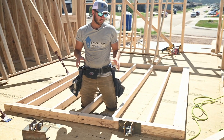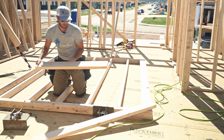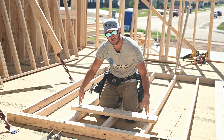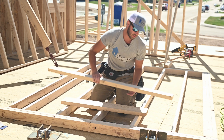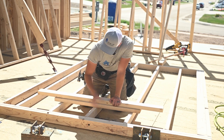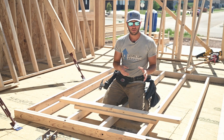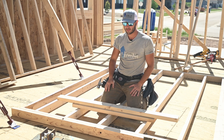The last way you can stand a wall with a tele is to take a board and screw it on top of your wall — even after it's sheeted. Make sure you use structurals into the studs and really load it up. Then take another board and screw it onto that board, and your straps can loop over these sections like a hook to stand it up.